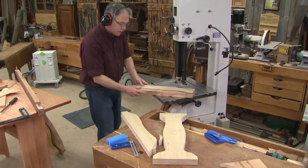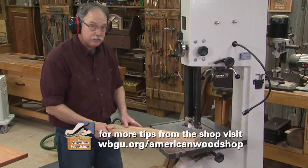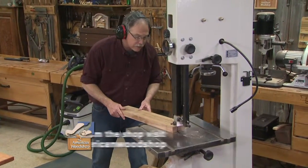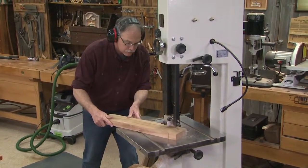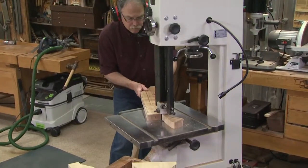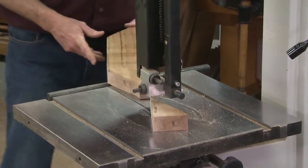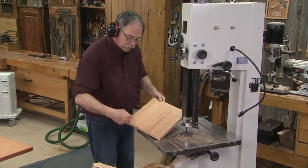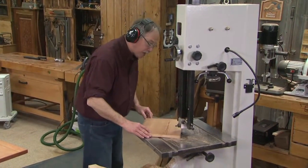That's how the post is made. Here's the base — 24 inches long — and I've got these templates at our website so you can print those off. I'll finish the base cuts and stay down to the outside edge of the top. I need four identical three-quarter inch leaf supports, 12 inches long, 11 inches wide. I'll cut those out, then it's over to do some domino joint work.